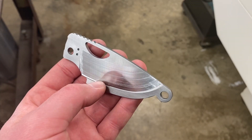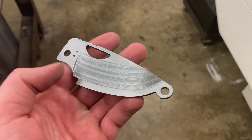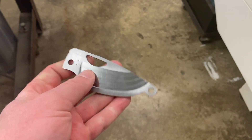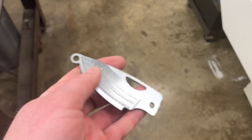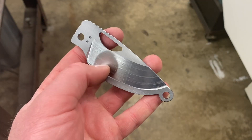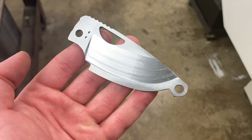When I'm doing these, it takes four operations. I do a semi-finish on this side, then a finish on this side — so op one and two are done. Now I'll flip it over, do a finishing op to get the rest of this cut, then flip it over to this side and do a finishing op. I remove material a little bit on each side to reduce any chance of warping. Every piece of steel is different and has stress inside it, so if you remove a ton of material off one side there's a good chance it's going to warp. I remove a little bit on each side and then finish on each side — it's a little more work, a little more loading and flipping, but well worth it because I know I'm not going to scrap out any blades.